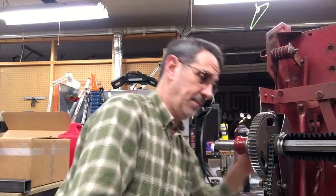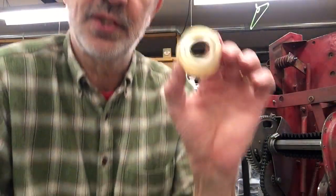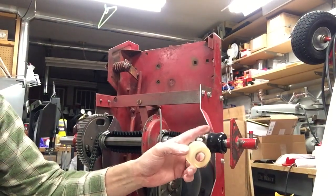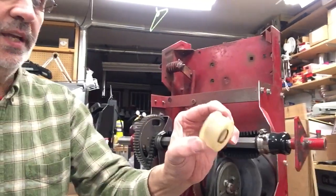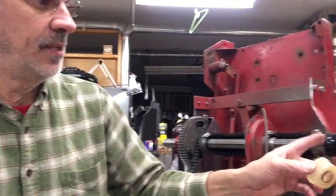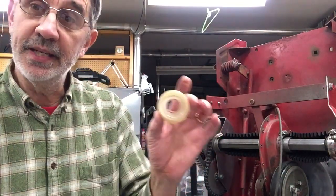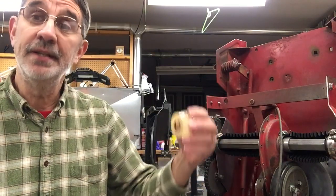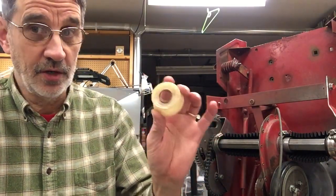There was a plastic dust cover — this was the plastic dust cover that went on the side without the differential on it. It was very hard; not much you can do with it. And once the bushing starts to wear, it also wears the cover. Then sand gets in and it destroys your bushing and your axle. These things, thank goodness, are no longer available.